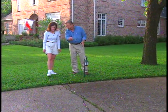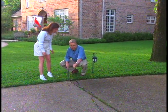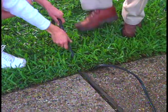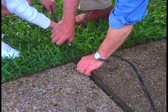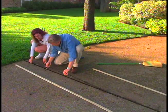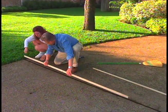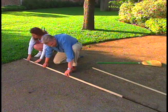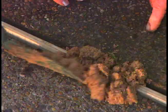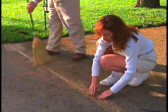Now we have a small problem — we've got to cross the driveway. To do that, we're going to take advantage of the expansion joint, which is put in to keep the concrete from cracking. We pry out the wooden strip from the joint, leaving an ideal trench for running a cable across the driveway. Cynthia lays the cable right in the bottom of the expansion joint. Then we lay new expansion material right on top and check that it's flush. We fill any gaps on the sides with sand, use a broom to work it into the crevices, and sweep away the excess.